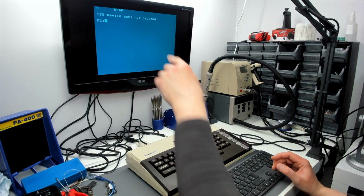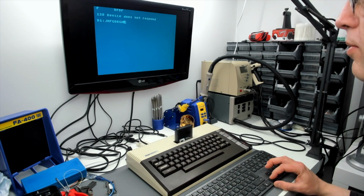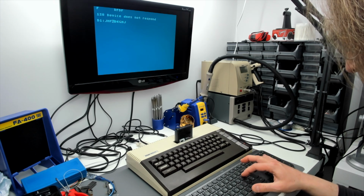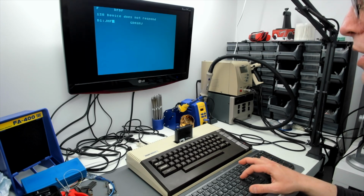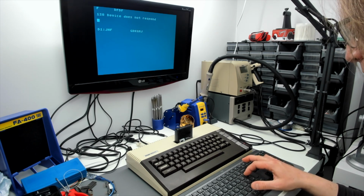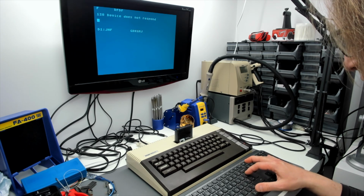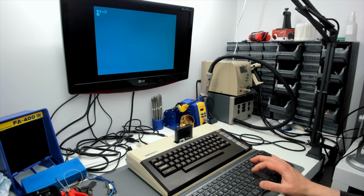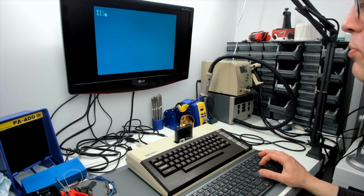So if we go back to the screen here, where you can see I've made a real mess. If I type some stuff there, I can cursor back over it, and if I remember that the left brace is insert, it's just counterintuitive, and we can shift and insert lines, and the right hand brace is clear. Yeah, it's completely back to front in my opinion. The left hand one should be the clear key and the right hand one should be the insert key on the curly brace here. But alright then, so we can clear the screen like that. Now the inverse video key is page down.